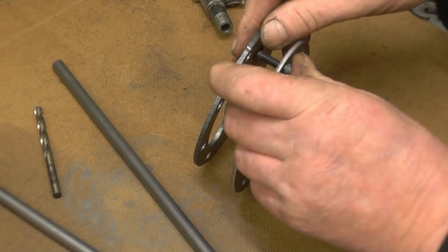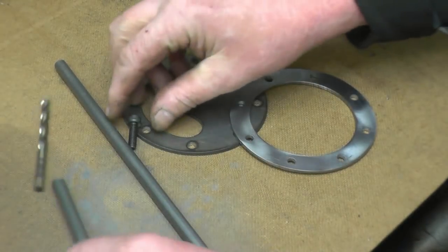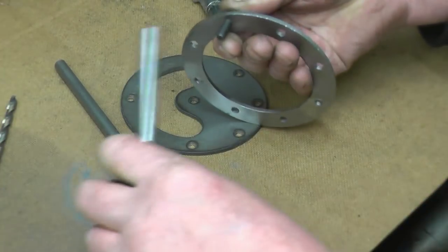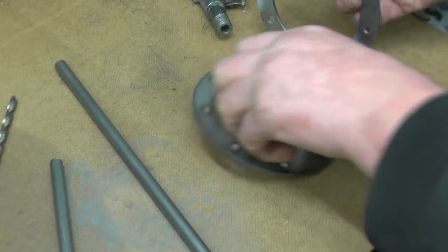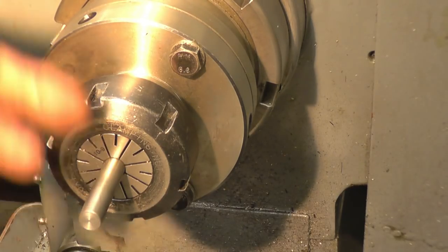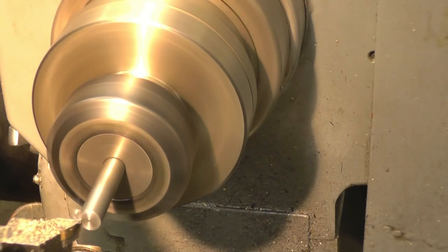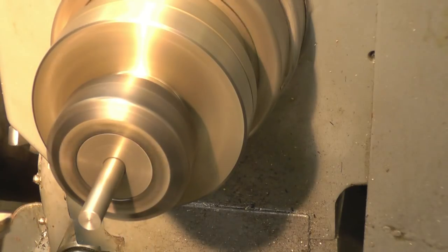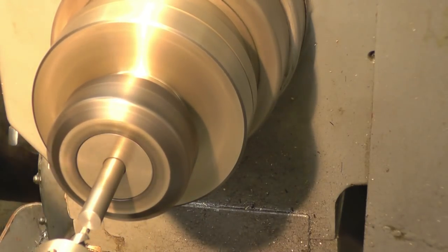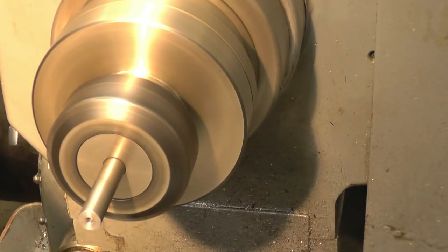These need to be about 25 mil apart, so what I'm going to do — I've got some three-eighths inch steel — I'm going to turn some spacers to go in between them, and I'll drill and tap them six mil so the six mil bolt will go through there and through into there, and the same on the other side. The plates will end up the right distance apart. I've got the bar in the collet chuck — I'm just going to centre drill it, then drill it 5.2 mil which is the tap drill size, then part them off to the right diameter. I'll just be facing the end before I start.